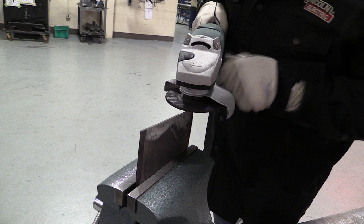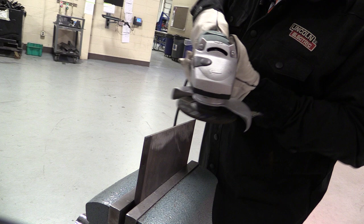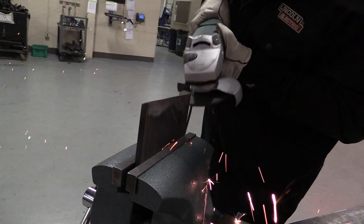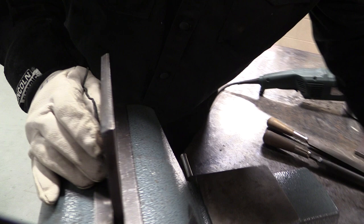So what I'm going to start with is just a couple runs across here with the grinder. A very important aspect — we can't do a rocking motion, because if you use that motion you're going to bevel off the edges too much and the middle will be too small. So we always want to start with our grinder from one edge straight across — nice, straight, smooth action. So here we go. I get this close and knock it down. This is my first step.